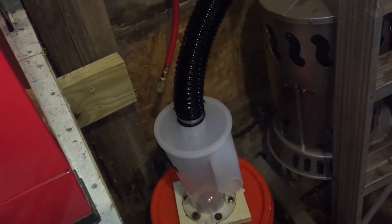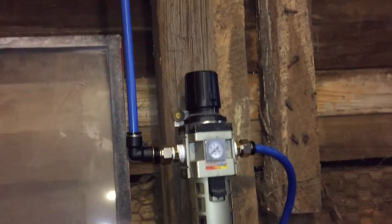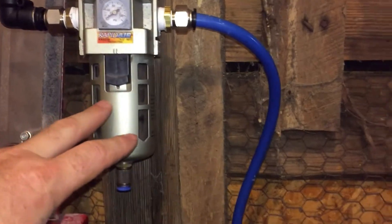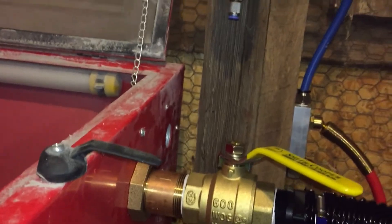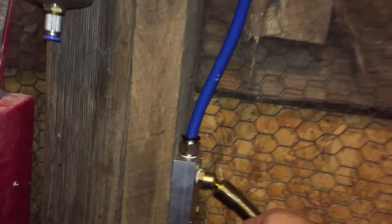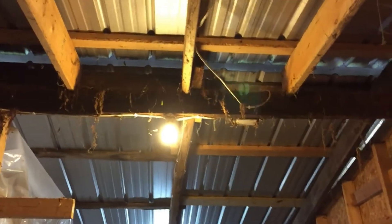I'm still waiting on a filter for my vacuum cleaner and I still have to run power over here. I got my air piped up — it's ready, with a little flex hose on the block and the regulator. I can adjust the regulator right here and we'll get about 60 pounds of air. It's got a filter on it so hopefully I don't get too much moisture, and I can blow the block down right here — just open this up to blow any moisture out of the circuit.